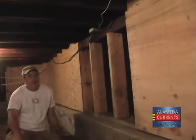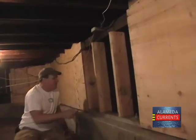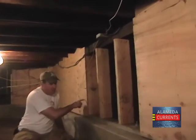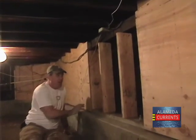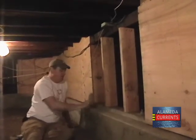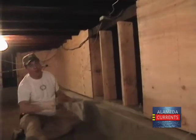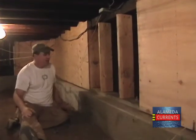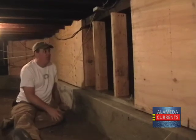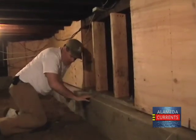But why is that important? Okay, well here we have what I consider to be one of the most important aspects of the whole process, the shear wall. This is the final connection of the first floor to the foundation, which in an earthquake is pretty much everything. Makes your house move in a controlled way, like a box, like a big strong cube moving all at once.